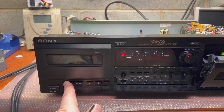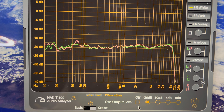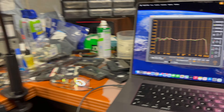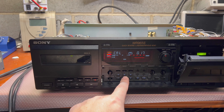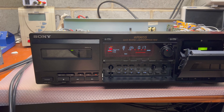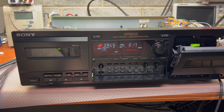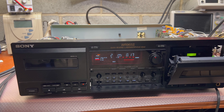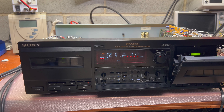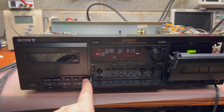With no calibration the recording shows the same picture. Playing back — it's a nicely tuned deck, reaching about 17 kilohertz at the minus 3 dB level. After this upgrade it will play even better than before. Before we had a really nice analog soft sound, and now the upgrade extends the high-frequency range, making it more detailed.